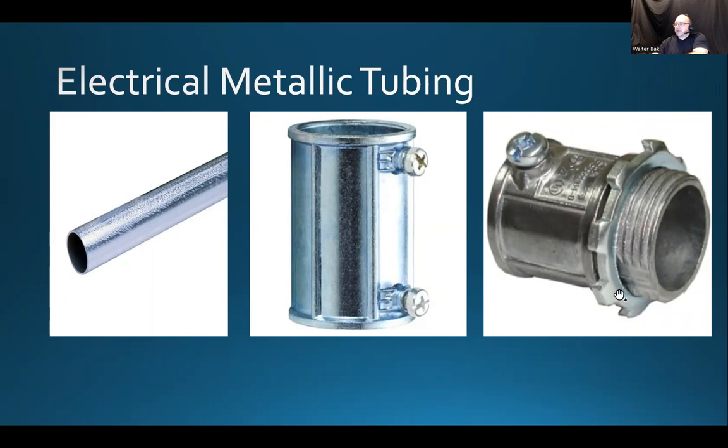That's what we did last time during the lab. We mounted a connector using something that's called a lock nut. So here's a lock nut. You take that off, put it on the inside of the box. You put the connector from the front, and this conduit fits right in there. So here's an EMT connector. And you can say EMT 1/2-inch connector, because I think this one represents a 1/2-inch EMT.